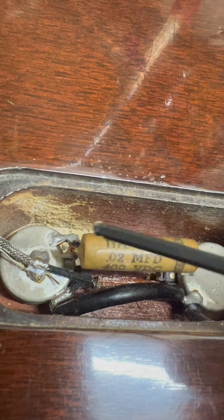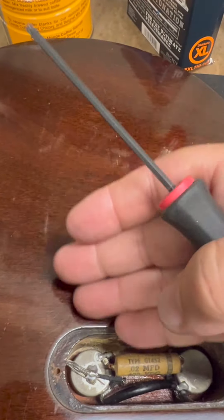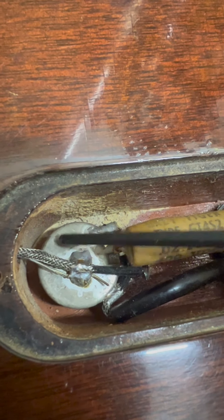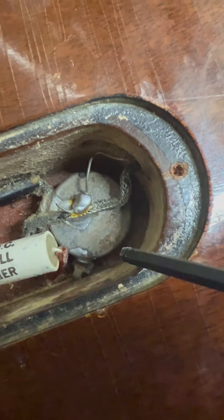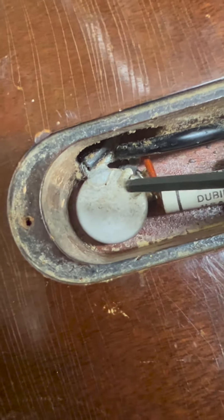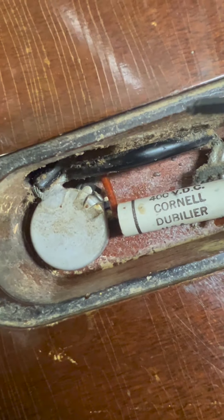Here's something inside here I want to point out. We took one of these guitars back in, but you see this dust that's on there — on the tip of my pointer? This is rubbing compound. What they'll do in these guitars, there's a buffing wheel that they'll put rubbing compound on — that's called a rouge or a rubbing compound. As the wheel buffs the guitar, a lot of that rubbing compound will come up and lodge itself inside. Also, looking closely, you can see a lot of these pots have residue on them, a lot of solder, and this one has this flux. This yellow stuff is flux and that will break down and set itself on the back of the pots. The pots have a bit of electromagnetic charge to them so that tends to gather there. And you can see this rubbing compound inside — I call that pixie dust, because you can see all of this pixie dust inside if you're looking close.